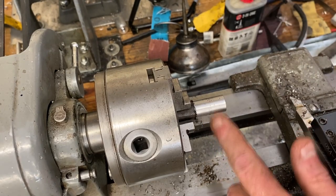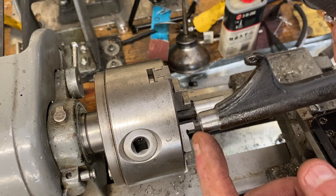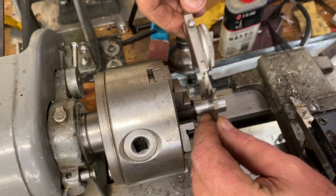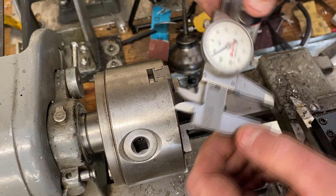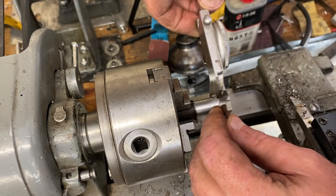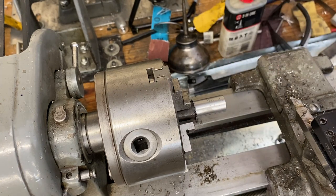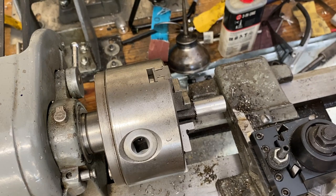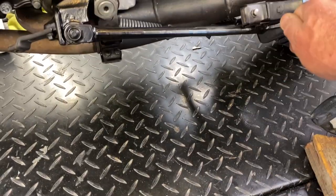You can see the bigger side used to be about 0.560 at the end. We'll make this 0.560 and it only gets smaller toward the foot. We're at about 0.587 now so we're close. We'll make it 0.560 — just grind a taper into it. It's not really critical but we'll make it on the large side.